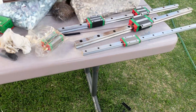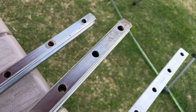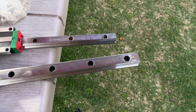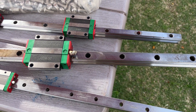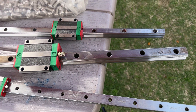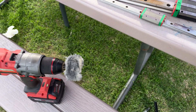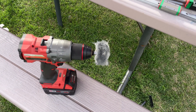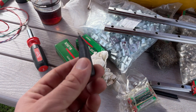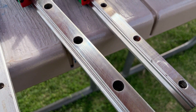If that happens, first identify if it's actually rust. This is oxidized oil — it was all up and down the rail and you just take acetone and remove it and it'll show shiny steel underneath. You may still have some rust on the ends, but that's because the oxidized oil becomes hygroscopic, absorbing moisture out of the air and then starting to rust. Even your protective layer of grease can turn into a water absorber over years. But a quick polish — get something with some torque, I use Ryobi polishing wheels from Home Depot with the black Emery or Jeweler's Rouge compound — and polish while keeping the grind marks intact.